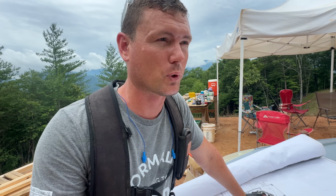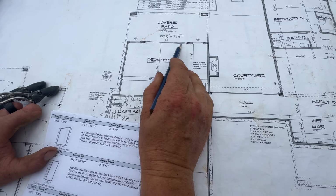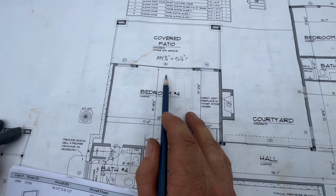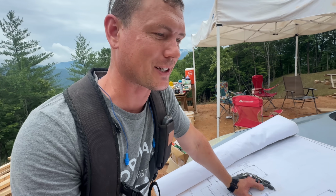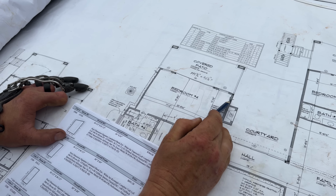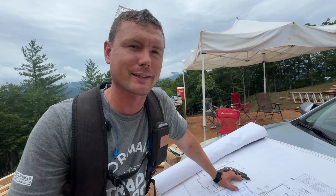There's so many factors to take into consideration here when we're framing because of our change of the floor system. And our floor system bearing actually rotated 90 degrees. In the original drawing, this would have been an engineered lumber header because the floor joist would run this way, bearing a floor load across that 12-foot opening. But now we're using trusses that are engineered also, and they span from this wall to this wall, free and clear span. So there is no floor load being applied to that header.